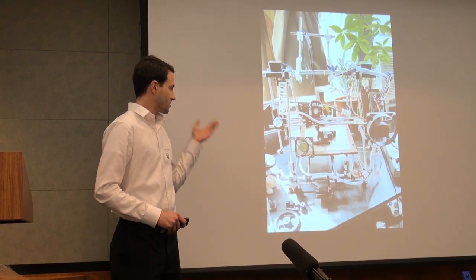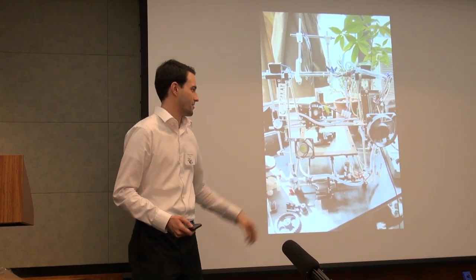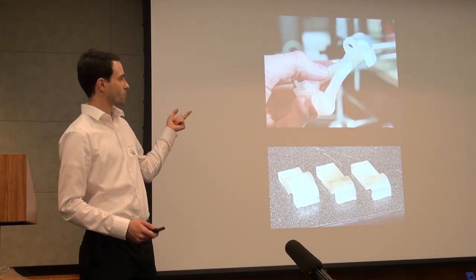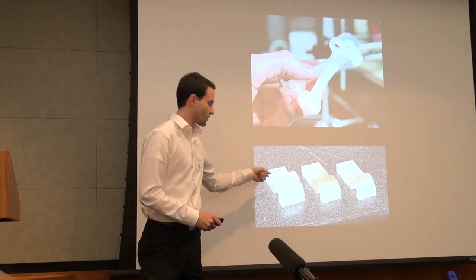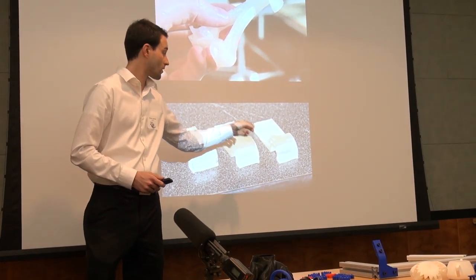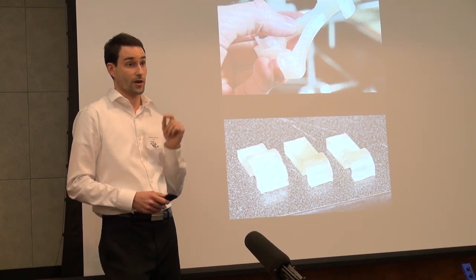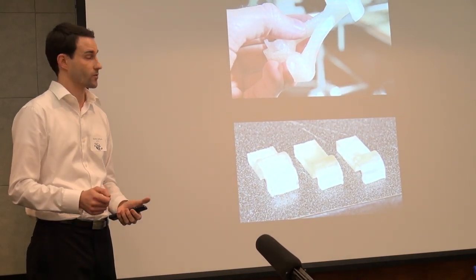Here's it printing just a part. This is not looking too pretty with the exposed wiring, but this was the first printer. When I first printed on the RepRap, one of the very first prints was not pretty — it's a pretty ugly print. Just by changing the software settings in the open source software, I achieved some pretty fine layer thickness, I think it was like 0.2 millimeter, somewhere around there, which looked great to me. I was shocked just by changing some of the software settings.